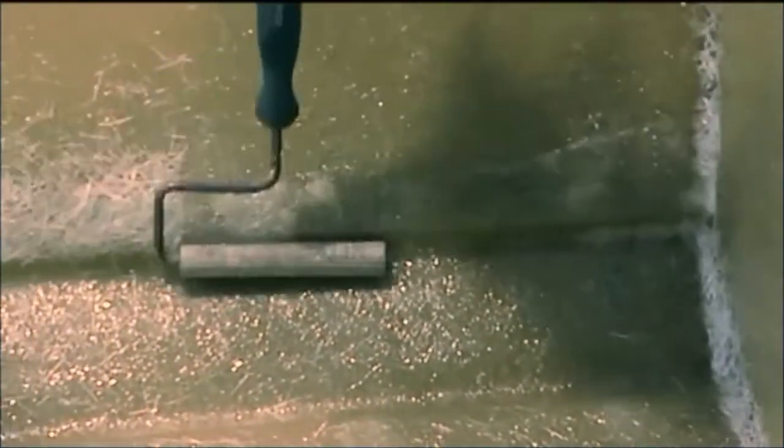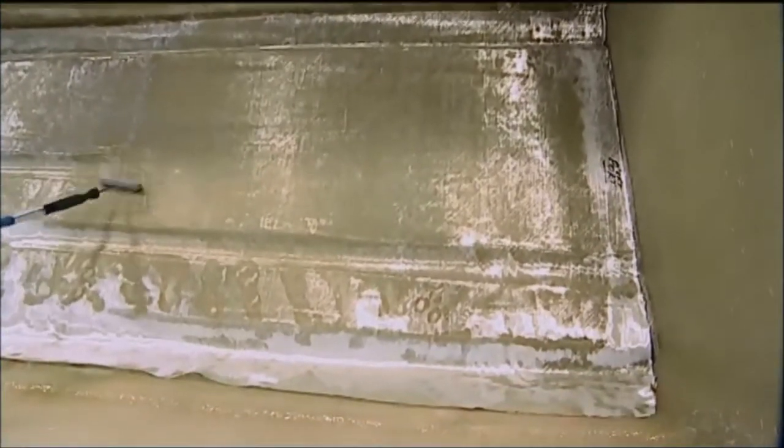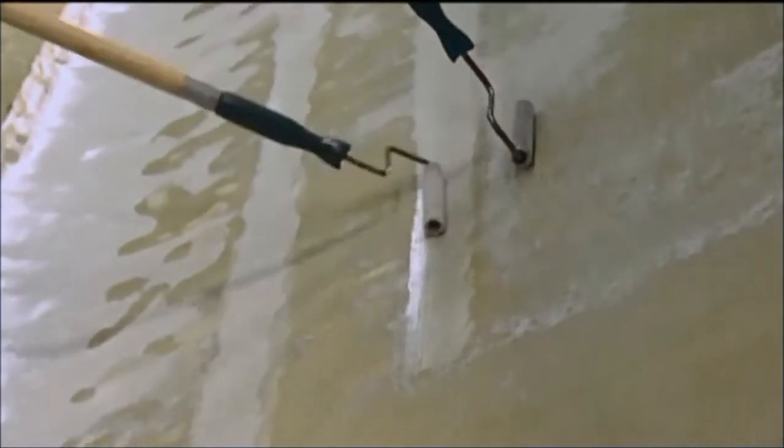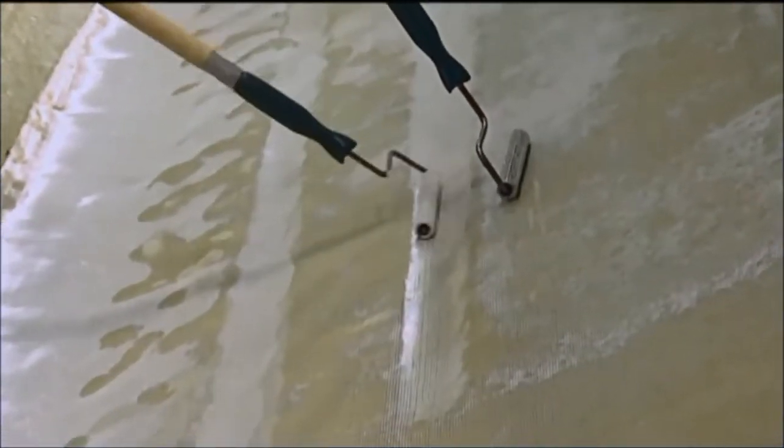The sprayed fibre and resin material is compacted using a roller to consolidate the mixture and to create an even and smooth laminate surface. This also ensures that the laminate properly adheres with the gel coat surface and removes any air in the resin matrix. The whole laminate is allowed to cure at room temperature, after which the part is then demolded and sent for finishing work.